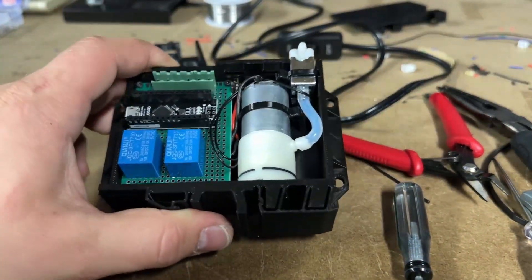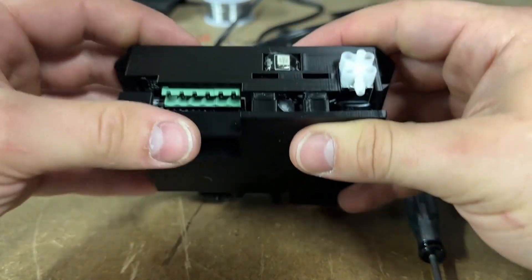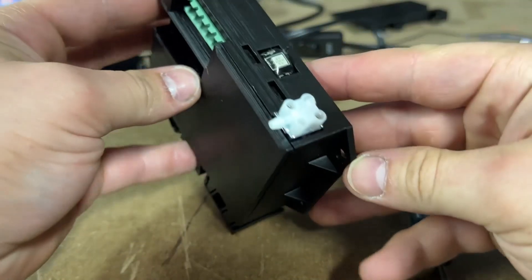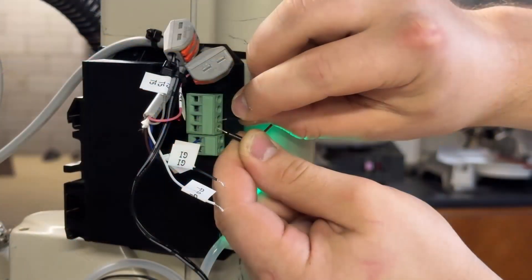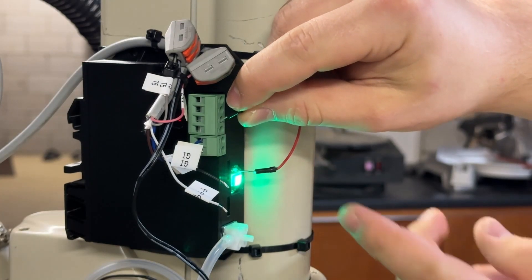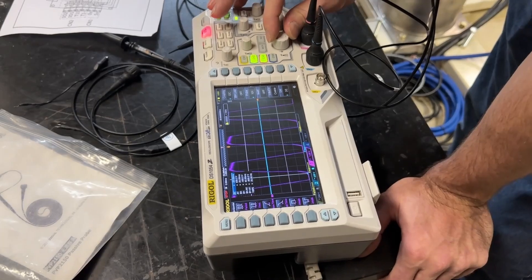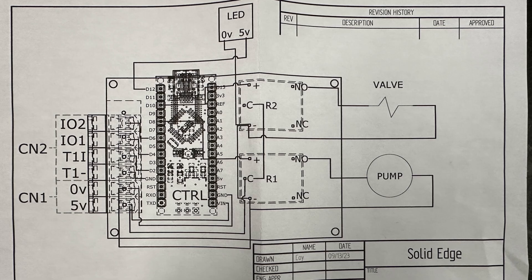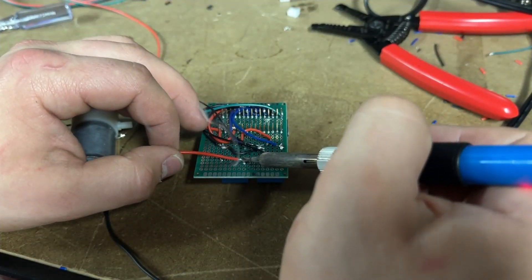Inside there's a little Arduino microcontroller for programming timings that controls a couple relays — the pump and the valve — as well as a status LED to tell whether the pump is on or off. They can either be bolted to a machine or snapped onto rail. I figured after over-engineering it I wouldn't have issues, but later I had some bouncing on the input so the gripper would turn on and off repeatedly. A friend helped diagnose the issue with an oscilloscope, and in the end I just filtered out the bouncing input and never had an issue with it.